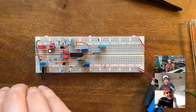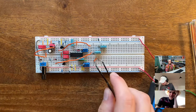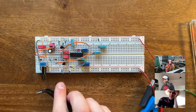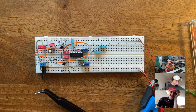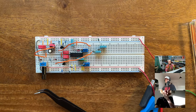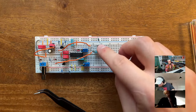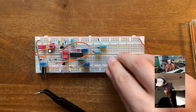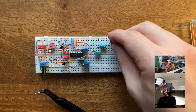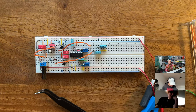Actually, it's interesting. Do you think it's easier than through hole, and faster? Oh really? Yeah, and it's much faster. I'm telling you. Faster, I can agree with, but easier depends on a lot of eyesight and shaky hands, how many beers you've drunk. And if you have flux or not. It's easier. It's so much harder to see if you did a bad joint, though. I think it's much easier to make a mistake with through holes. You think? Yeah, because you need to apply more solder and you can more easily break the copper routes on the PCB itself. That might be true, actually.